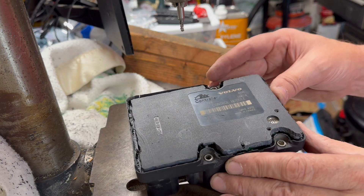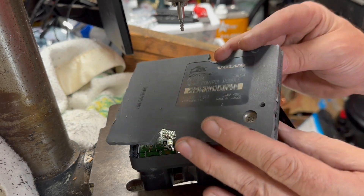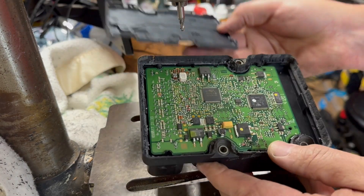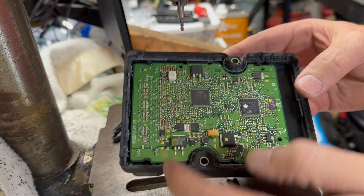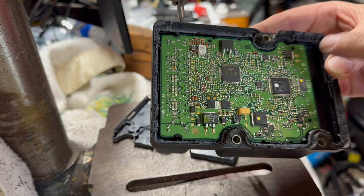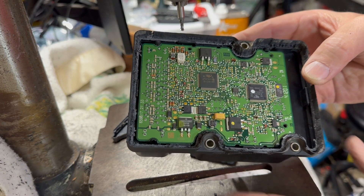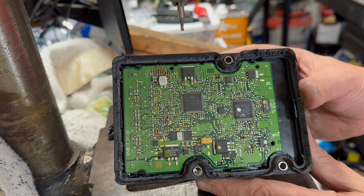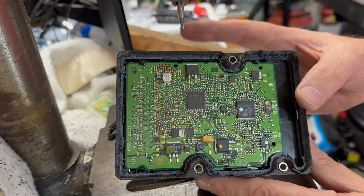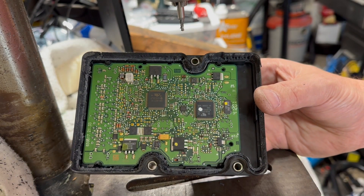It's all done — it turned out not as good as I had hoped, but not too bad. I pried the lid off and still have a lip around the edge, which is nice for gluing it back. Here's the inside of the ABS module — there's no solder on these connections at all, which is the problem. I'll solder them up and glue it back with RTV silicone. If you had an actual mill it'd be a lot better, but it's definitely doable on a drill press. The end mill was better than other methods I tried — give it a shot, let me know in the comments, thanks, like, subscribe, and I'll see you next time.